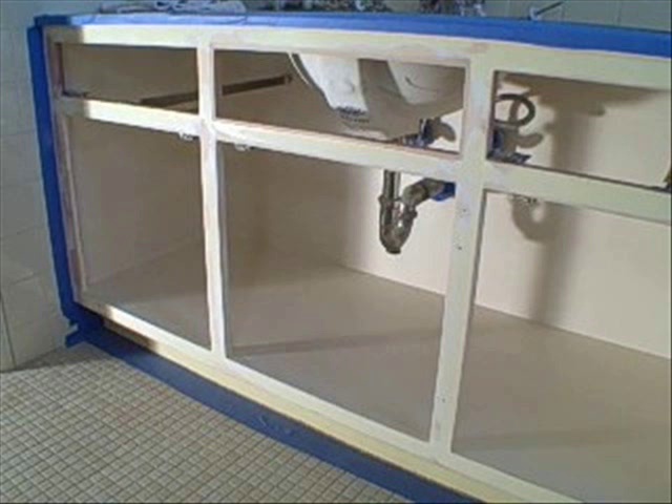We chose in this application to paint the inside of the cabinet a beige color. The outside of the cabinet is going to be a flat black finish. Because the wood was in such good condition, we went ahead and just used spray paint right out of a can. You can do that — it's not necessarily the best application; the HVLP sprayer is much better and more economical, since spray paint is more expensive than buying a quart or gallon of regular paint.